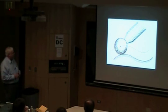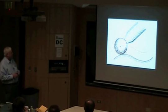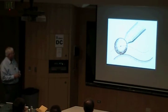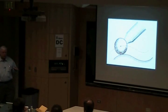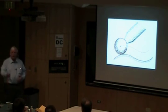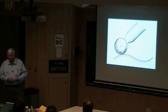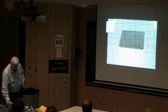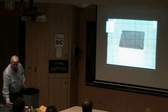I point out that when you're making one of these, the tool path isn't the same as the shape of the part. You know, in most obvious form, when you're cutting the convex part of the part, you add this radius to the radius you want to cut. And when you're doing the concave part, you subtract. Well, for a freeform that's complicated, you do different things in different places in 3 dimensions. And, you know, John Mader here conducted a lot of that for us. But we were able to work out the path for the machine that would do exactly that.